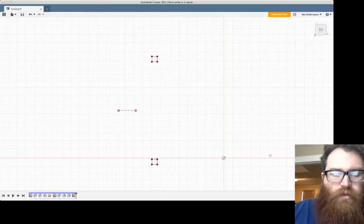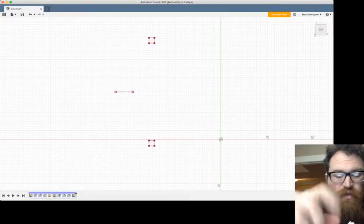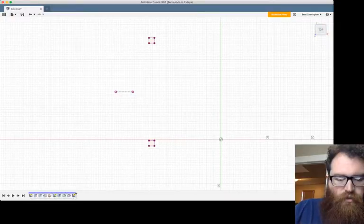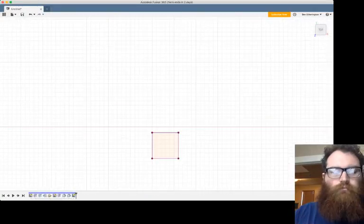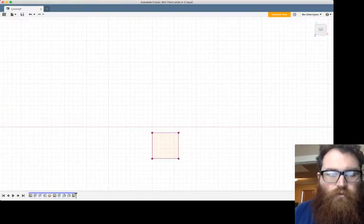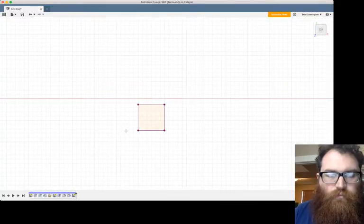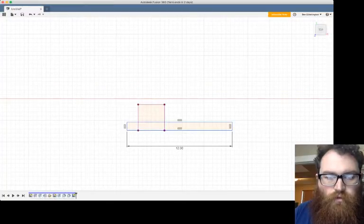All right. So the hand is going to have to go on the outside of the arm because I know I put these arms up 5 centimeters, but this is actually going to have to clip into it. Okay. So let's build this. This strip is 12 millimeters wide, so let's do a rectangle. I'll grab this sketch line and this sketch line and say midpoint, and they'll snap together.